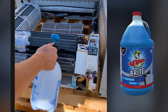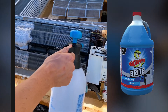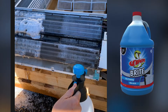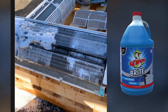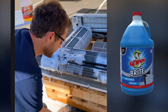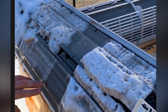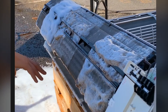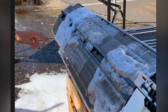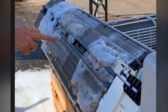Now I'll go onto the dry coil so you can see the difference — it will still react and still do an effective clean, but it won't be near as good as a wet coil. A lot of techs think the stronger the concentrate, the better it's going to perform — that's not the case. Using a 1:2 dilution of Viper Bright is no better than using a 1:4 or 1:5 dilution; all you're doing is wasting chemical. See how the foam didn't last as long on the dry coil. The general rule for how long to leave chemical on a coil is around five to ten minutes, until you start to see the foam liquefy.